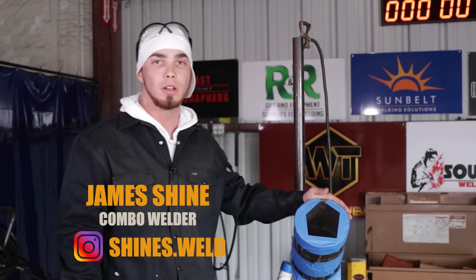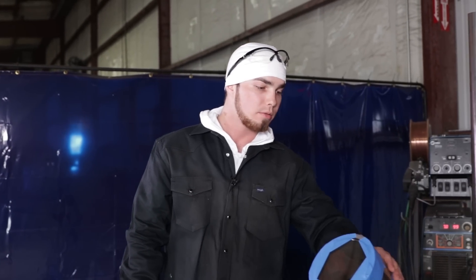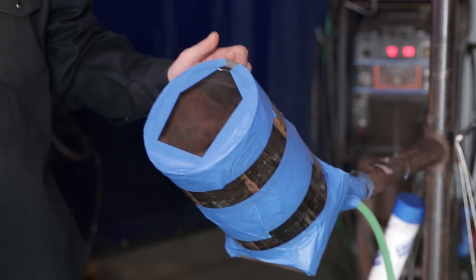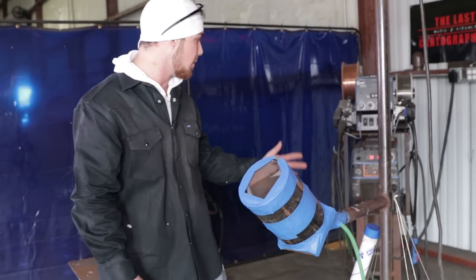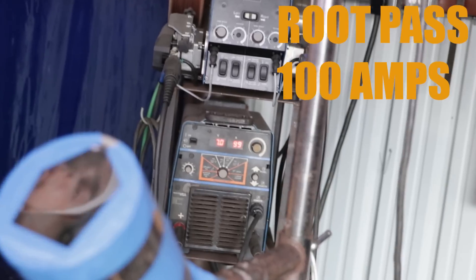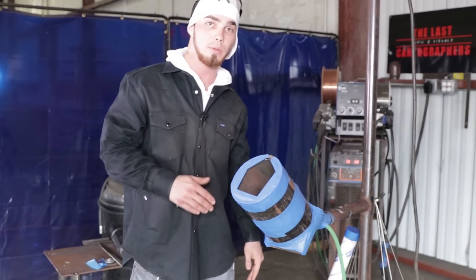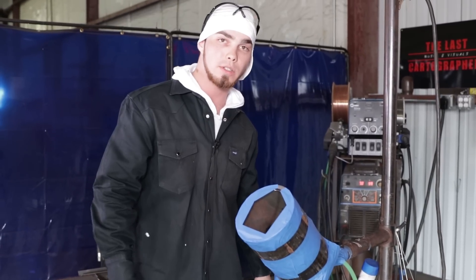It's James. I'm a Houston welder, been welding about five years. Today I'm gonna show y'all a little bit of how to weld some Inconel. What I'm gonna teach y'all today is we're gonna run through some Inconel combo. We're gonna start with an Inconel root 625 — it's a six inch schedule 80 — and I'm gonna be running about 90-100 amps. Make sure you got a good purge when you're doing Inconel. It's a really dirty rod. After each pass you want to clean it, make sure you grind your stops and starts, make sure you feather real good.